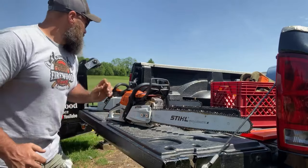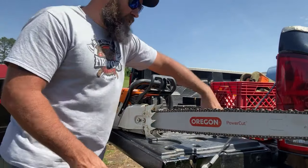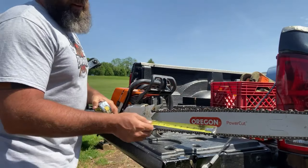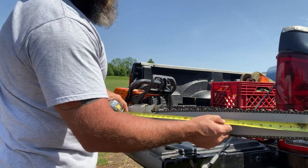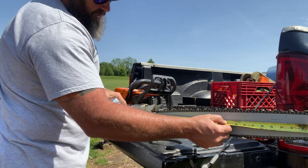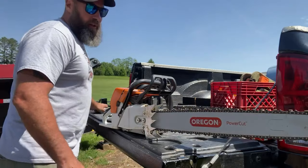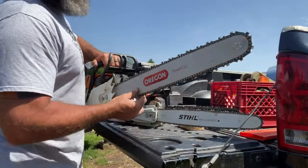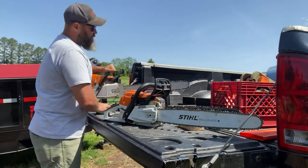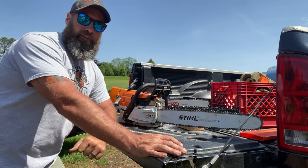Here on this 460 clone we have a 24 inch bar. We'll take a measurement on this and the measurement is about 23 and a half, so we'll round up to 24 inches — that's a 24 inch chain. So that's the easiest way to measure the length of your bar.